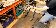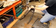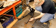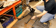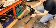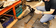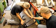Okay, so here we are on a very rainy day, but no matter. The first step then is to work out what bend we need here using some welding wire, and once we've done that we can replicate that bend on some tubing that we've got for the tube bender. And so that's what's next. Put a new tube in place.